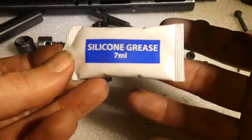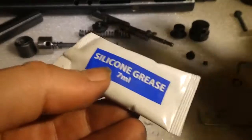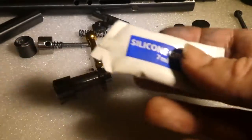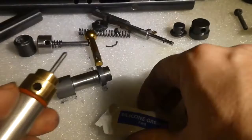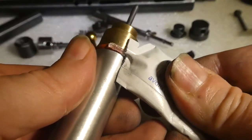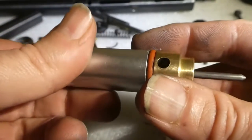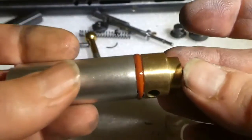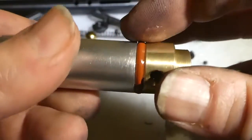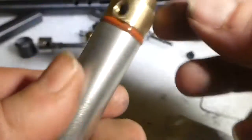For your seals, use silicone grease — again cheap, but it does the job. Keeps the seals lubed, keeps everything nice — but only for the seals. To put it back together it's basically the reverse of disassembly. Put a small amount of silicone around the seal — you don't need to go mental with it, you're just using it to stop this from sticking as it passes through the cylinder.